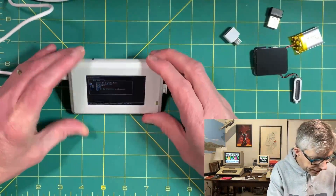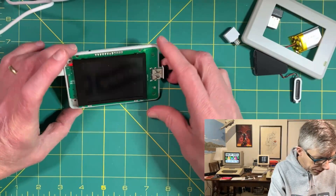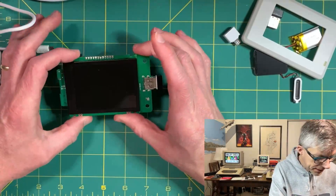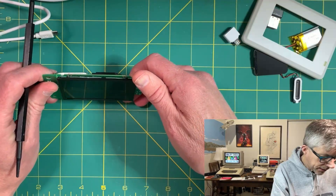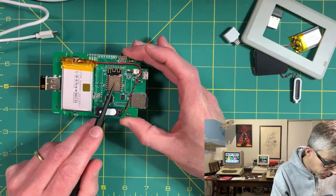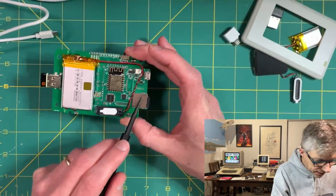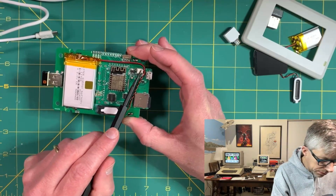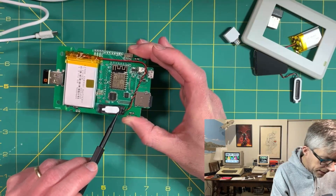Let's just see for fun what's underneath the hood of this thing. So let me turn it off and pop the case off. It actually comes with some screws, but I haven't attached those. So here's the board itself. We basically have the LCD on this side, and on the back you can see the LCD. This is just a stock screen that MFA2 has gotten. And then here is his custom board — you can see he's got the custom micro controller here. It says Wi-Fi on it, so I have a feeling he's actually using a Wi-Fi chip as the actual CPU, but I'm not 100% sure about that. Here's the micro SD card. This is the USB for charging the battery or for powering it. And this is actually where you plug in a battery, with a standard adapter on it. And finally, this is the little micro speaker that is included with it.